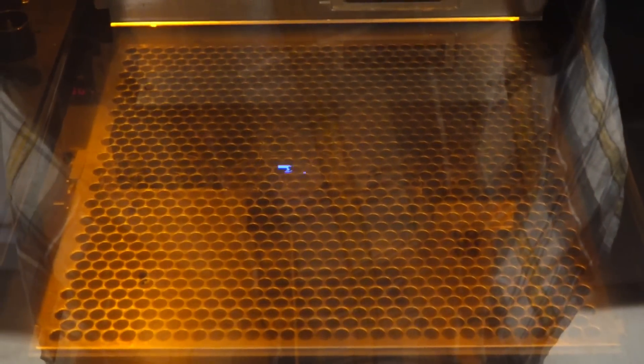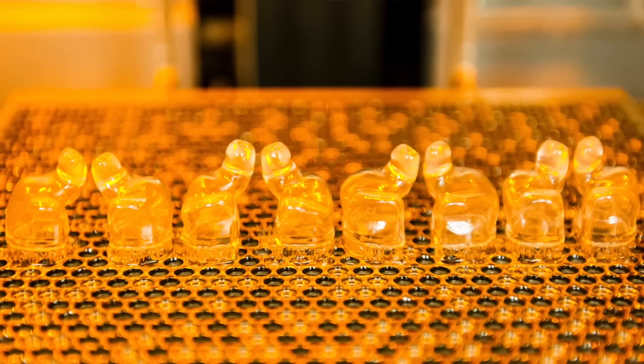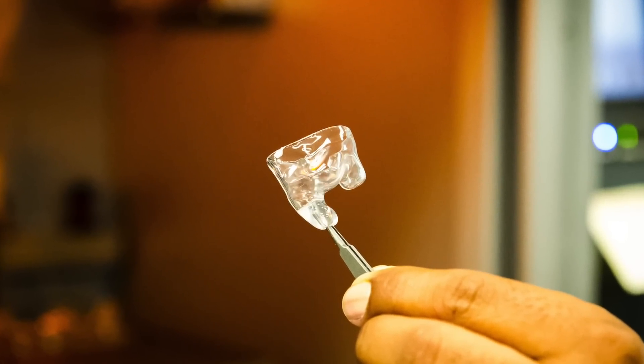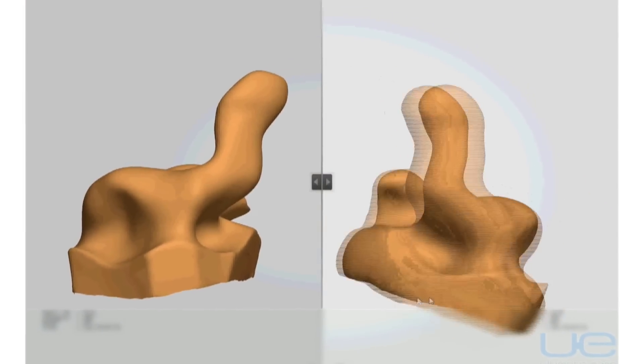Once the detailing is done and they've achieved the final shape of the virtual shell, it is then 3D printed into reality. The type of 3D printer Ultimate Ears chose is a very high resolution stereolithography, or SLA, 3D printer. Unlike plastic filament type 3D printing which can leave a coarse finish, the SLA printer utilizes a vat of liquid resin cured by an ultraviolet laser to create the shell. The resulting shell comes out of the printer glossy, glassy, bubble-free, and ready to stuff with components — needing no additional buffing or polishing. It is a perfect physical representation of the laboriously sculpted digital impression.